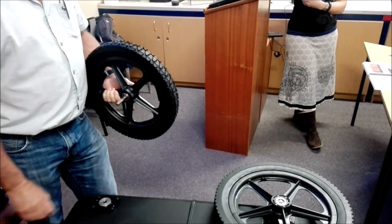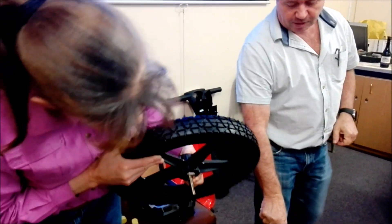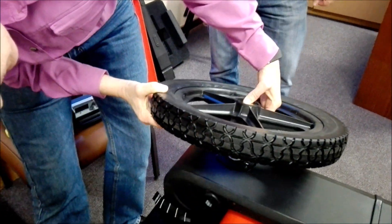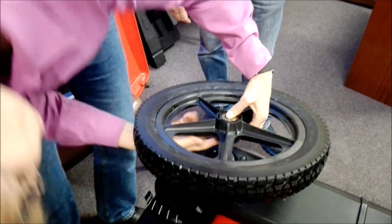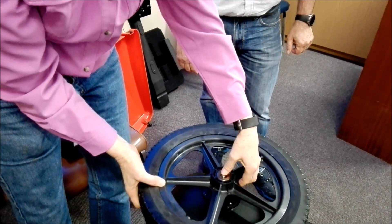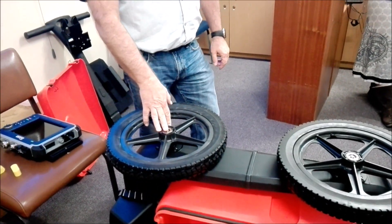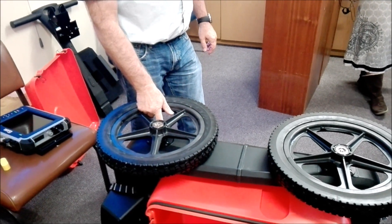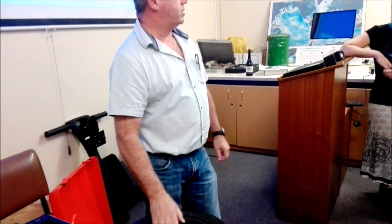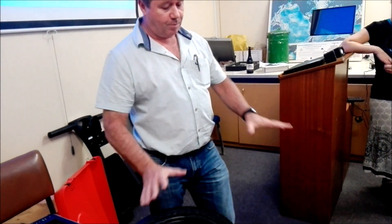When you damage this little lip, you're looking at about 4,000 to replace each one — 16,000 range if you damage all four. You line the flat edge up with the flat edge; it can only go in one way, then put the pin in and you can feel it's located. The second thing: sometimes you'll hear these squeak a little bit. Don't oil them — never oil them. Oil just creates grit, a grinding paste, and destroys them. If you want to put something in, use graphite powder. But if you look after them, you shouldn't have to put anything in. The bearings are pretty robust.